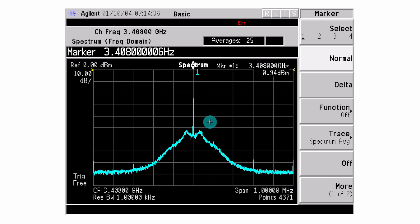In the last video I showed you the phase noise that comes with our main tone at 3408 MHz, and the fact that this could cause an issue when we try to listen to very small signals — particularly when doing long-distance 10 GHz communications in the presence of a stronger signal in the vicinity of our small signal.